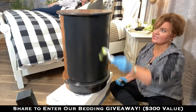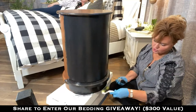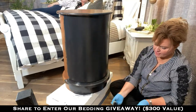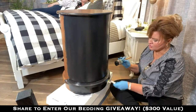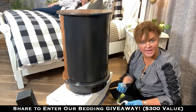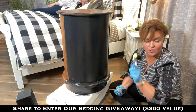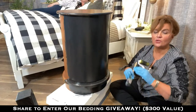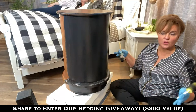Here's what to do: this product dries fast, but anytime you're painting a big flat surface, you've got to get the paint on all at once — meaning that whole surface needs to be wet at the same time. If you paint very thin light coats, it's going to dry before you can ever get a roller run back through it. It's important that you do the brush-and-roll technique just like I'm doing here. If that were a big tabletop, you've got to cover the whole thing. If you're painting a wall with black, you've got to keep a wet edge — meaning when you make a pass down the wall, the next pass has to overlap that wet edge.